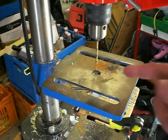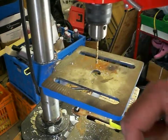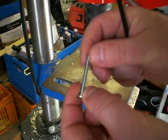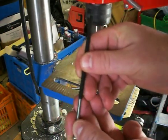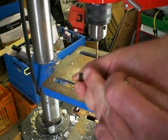First step is to drill some holes in the board. I'm going to be drilling 3.5mm holes because I'm going to mount the workpiece on an M4 bolt to work on it. I chose this because that still gives me some scope to enlarge the hole a bit later to make it fit the cross section of the Lego shaft.